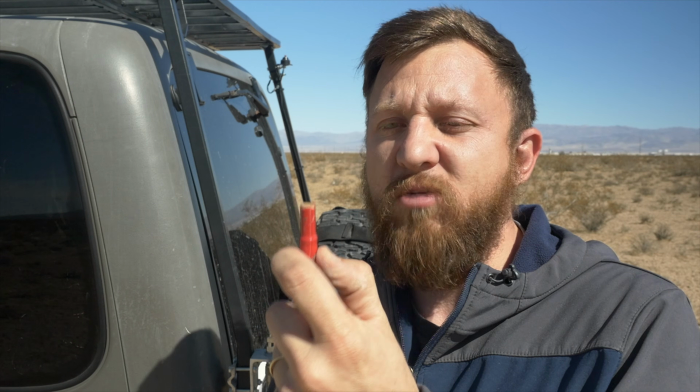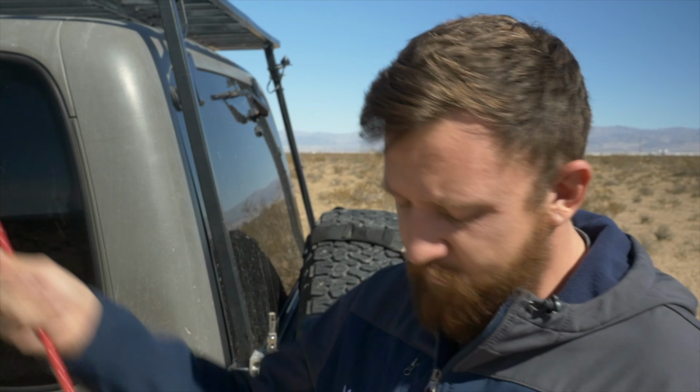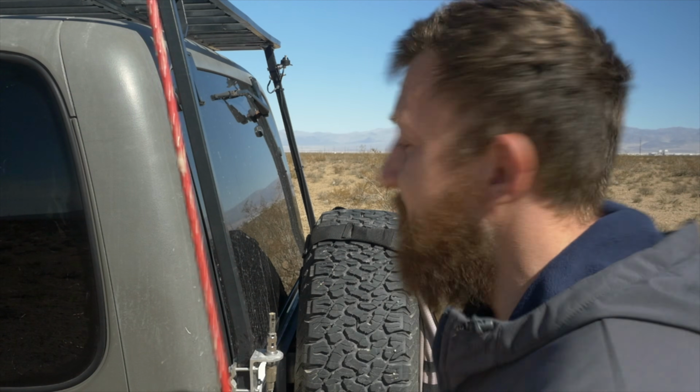Mine, my SWR is actually really good. But if you have one channel that's extremely higher than the other, you're going to want to adjust that. You just want to keep your stuff out of the red. That's basically what you want to do. You want to keep it below 3. 1.5 and lower is completely ideal. 2 to 2.5 is okay, but you want to keep it as low as possible. And this really sucks. If I had known this, I would have grabbed a different antenna. Well, it is what it is.